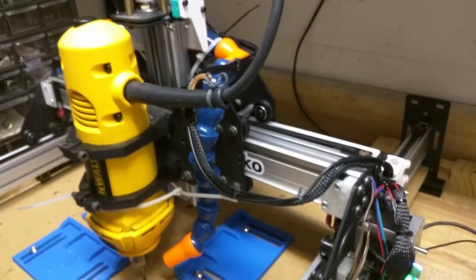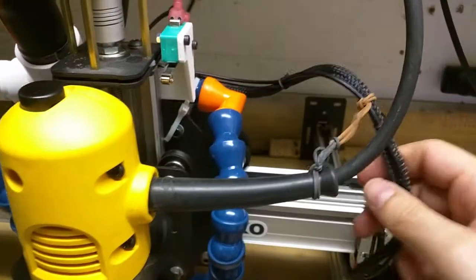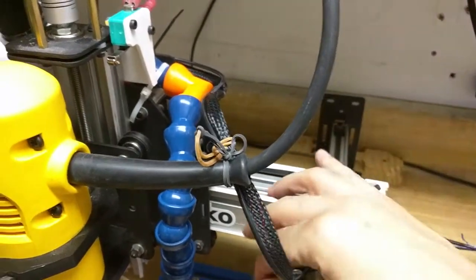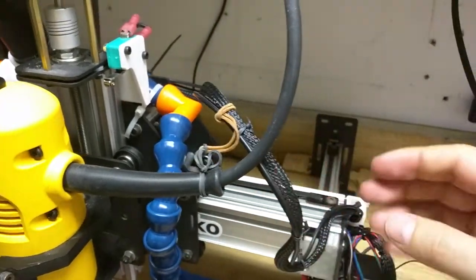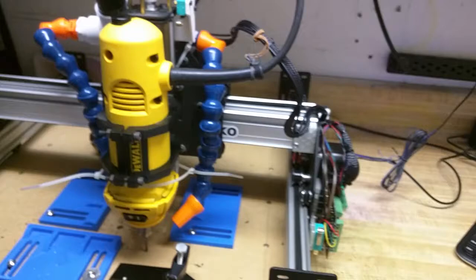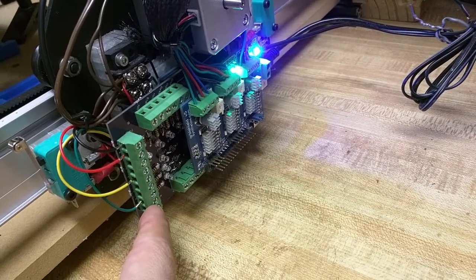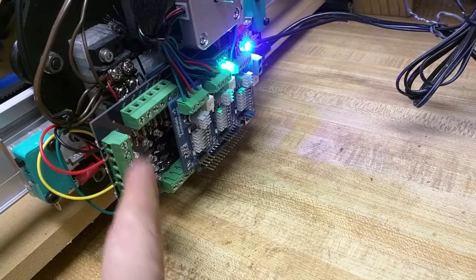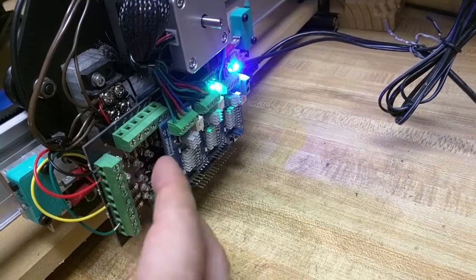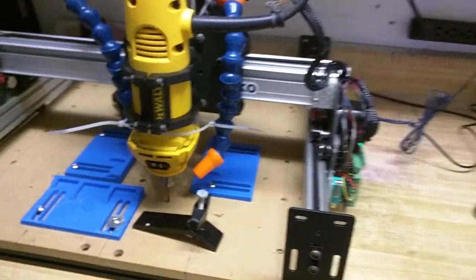All in all, it's been a great weekend of upgrading the machine and getting all these things done that I wished I'd had for a long time. I also hooked up some things to manage my cable a little bit — I don't have a proper cable drag chain, but rubber bands here have been working out to keep it from sagging down and catching on my work piece. Anyway, I just wanted to share that in case it sparks an idea. If you're interested in the limit switch shield, just today the guy who designed it posted all the drawings on the forum, so you can either order a board or mill out a PCB and populate it yourself. He open-sourced all the hardware design and I can vouch for it — it's a fantastic board. Hope that gives someone some ideas or inspires an upgrade. Talk to you guys later.